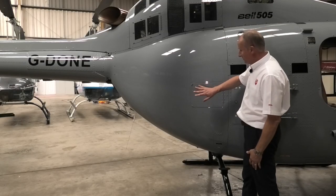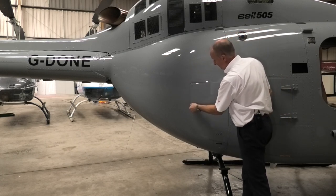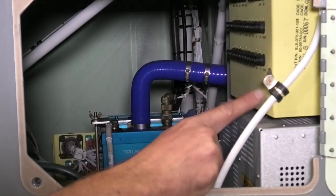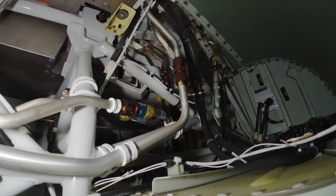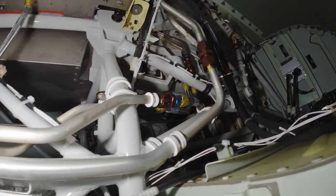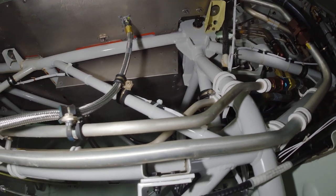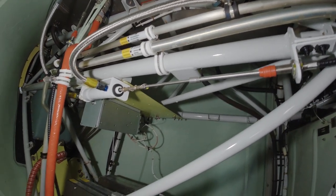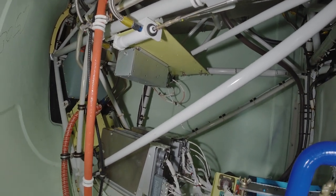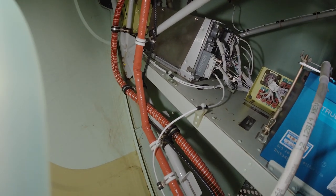One of the only panels we do have to open on this aircraft is this one here. We're looking for the circuit breaker panel — we check all the circuit breakers are in. We check the battery, which is a lithium-ion battery with a huge amount of power. We check the bottom of this part of the panel for any oil leaks or chafing — there are none. There are a lot of electrical connections in this part of the airframe. Looking back we've got all our boxes, so we check the integrity of those and that plugs are all in. We then look at the bottom side of the transmission area, checking the live mounts, the engine tray for any leaks, and all the wiring and pipes — everything looks absolutely fine.